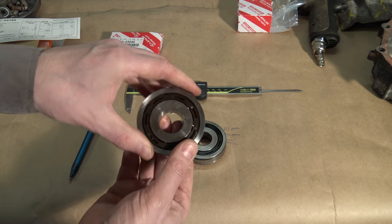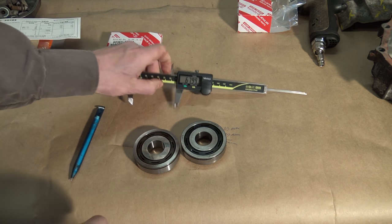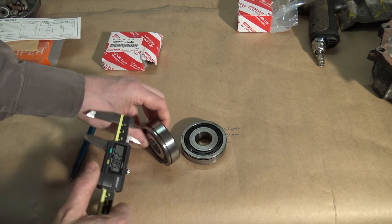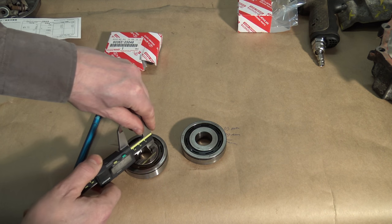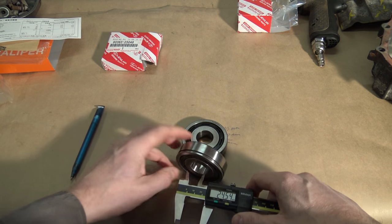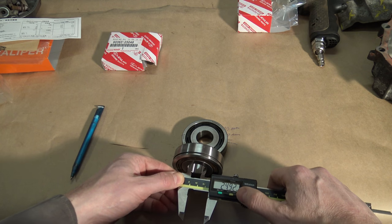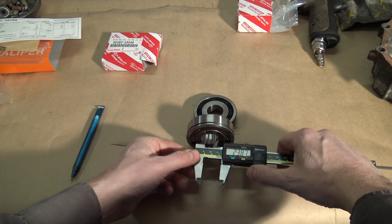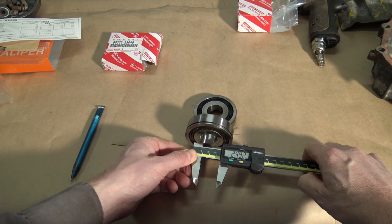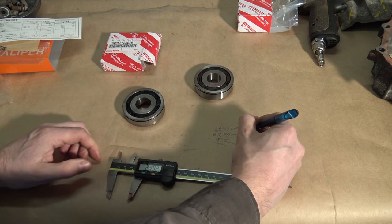And when we insert that in our bearing in this place, there is always some wear in the inner area. But let's look at what my tool says, now that I use this part. And I insert my tool, and in the central point, this is a little bit complex measurement, because I have to measure this in the right place. And now I believe that this is the most, 24.92,